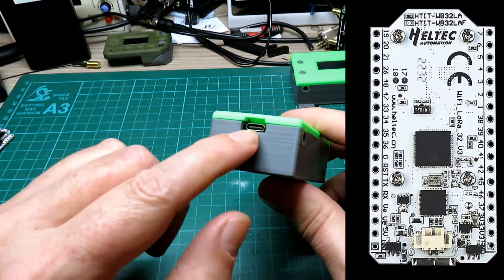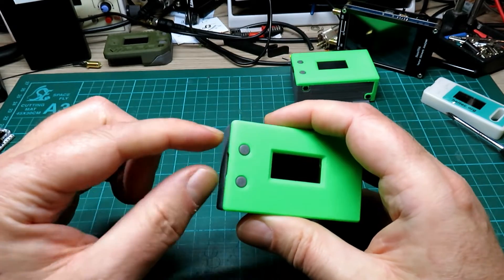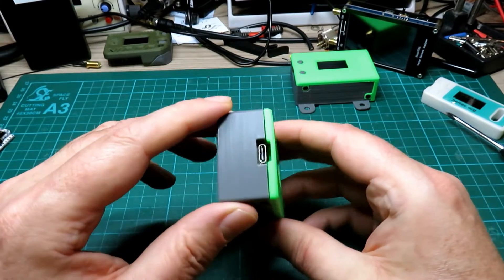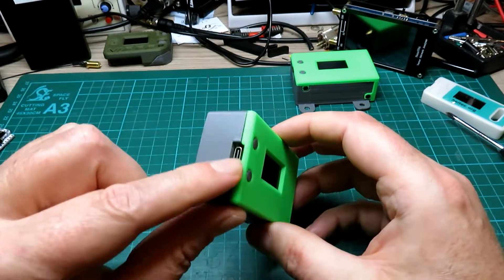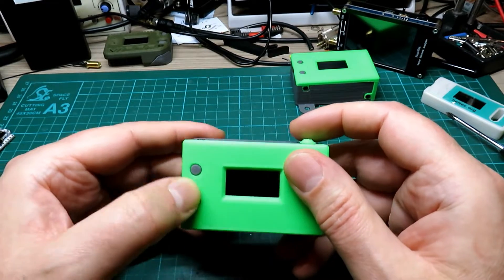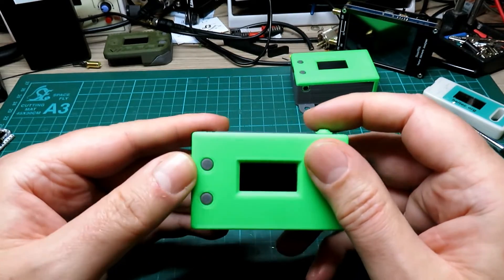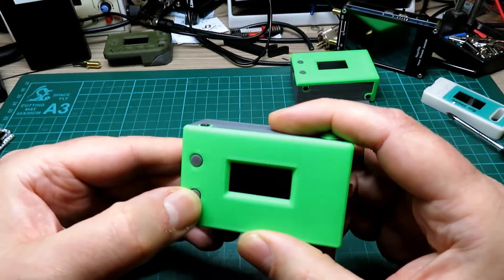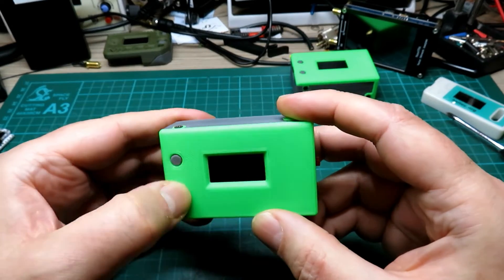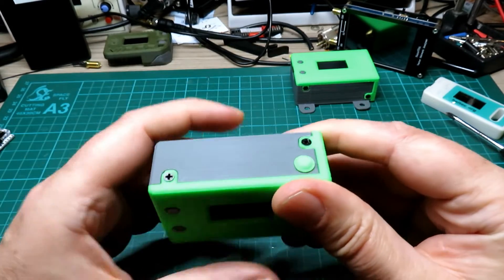You can see a nice generous accessory hole there for USB cables. On some of these case designs there wasn't enough room to get some of the bigger USB cables — the outers are a little bit bigger on some of them and they don't mate very well with the connector. So I made a nice hole there. I'm not so keen on some 3D prints where buttons are just a thin bit of PLA that over time could break. On this one it's got separate buttons that you print — a nice positive click — so they're not going to crack or snap off.